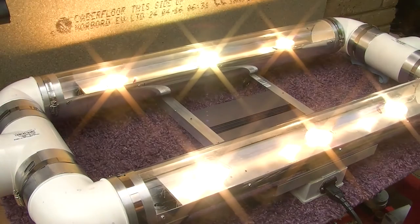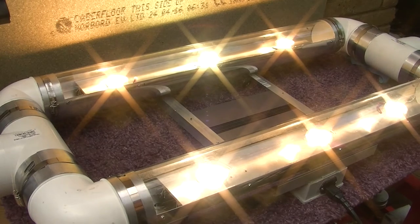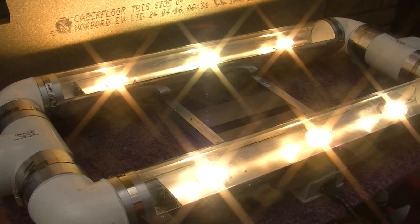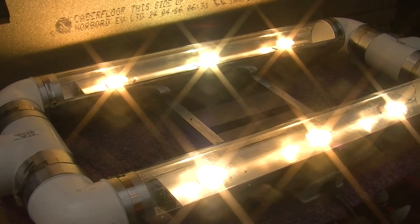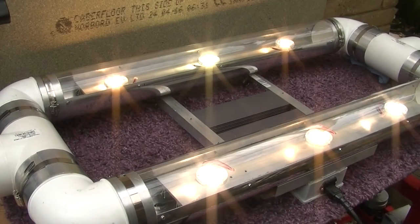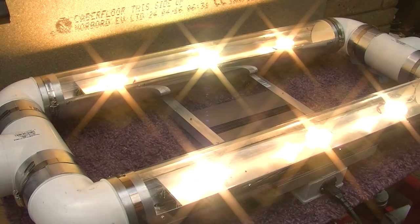And up she comes — a beautifully sensitive dimmer switch. Only about 50 watts... about 100... 150... 200... 300... and all the way up to 440 watts. The power supplies are capable of 480 but I've limited it to 180% overdrive just to protect the COBs, to keep them away from that maximum 200%. You can see all the COBs lighting up and dimming beautifully evenly off a single pot, a pair of dimmers, and a pair of dimmable drivers. Very happy with these drivers.